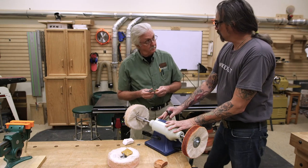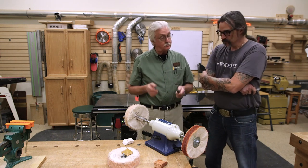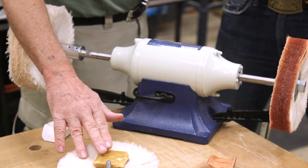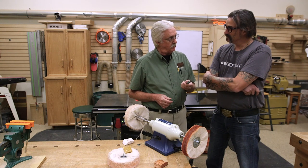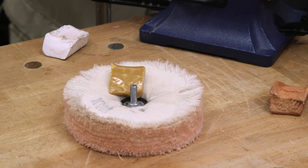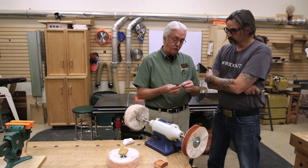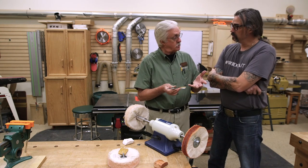So Howard, I've got a metal polisher back at the shop but I've never used it on wood. This is called a Beall buffing system — B-E-A-L-L. It combines three different buffing wheels of different fabric, and each buffing wheel is labeled Tripoli, White Diamond, and Carnauba. Carnauba will be our finest polish — it's hard as a rock. You'll only have to do this one time; it will literally last forever. Carnauba doesn't wear off — not finger oil, water, acetone, alcohol, nothing bothers it. This will literally stay polished forever. The beauty of it is it's not a finish, so if halfway through we discover we missed a spot at the sander, we stop, you re-sand it, and then just buff again. Because it's already dry.